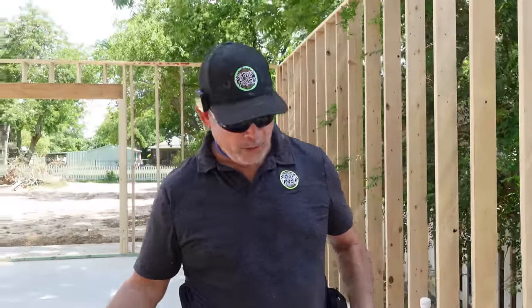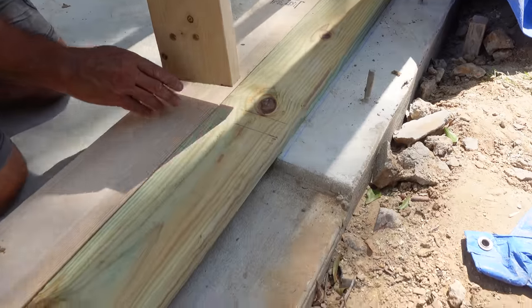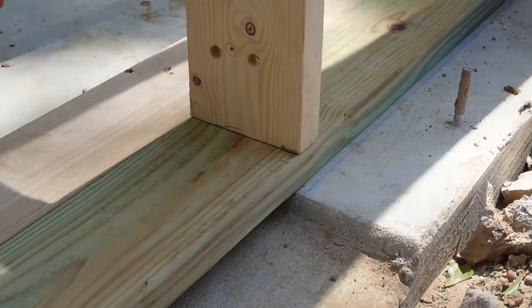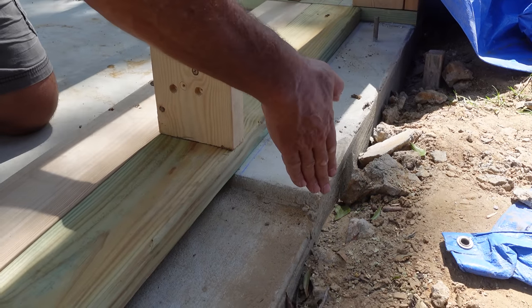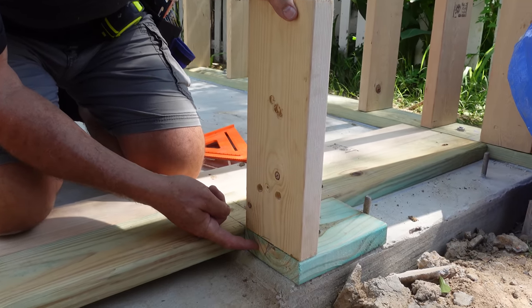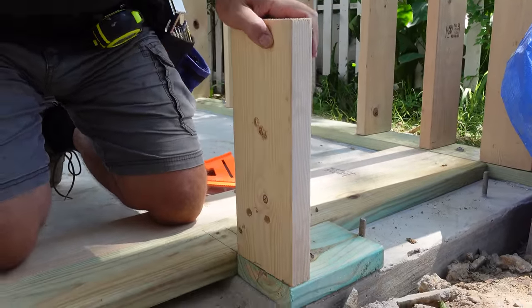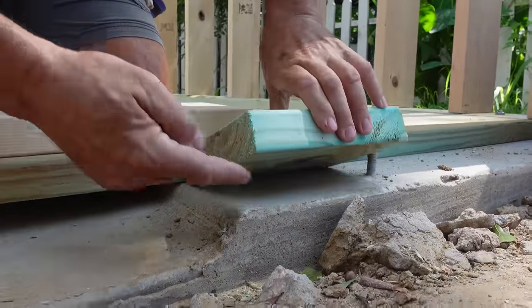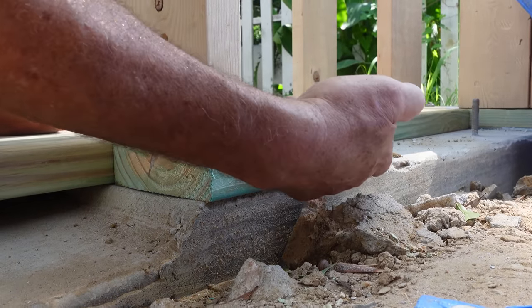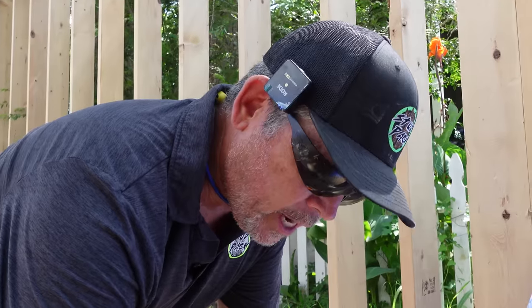What's the rough opening for an 18-foot wide garage door? It's 18 feet — from the jack stud on one side to the jack stud on the other. We're going to set this back another half inch because we're going to wrap our zip sheathing — which has an integrated water-resistant barrier — around this corner. The jack stud has no defenses otherwise; typically they use a piece of 2x with a big bead of caulk that fails, gets wet in driving rain, and rots. Staying on a bulletproofing note, we'll also put Lexel under here so water doesn't get under the end, and possibly Lexel between the framing and the inside of our sheathing to help our blower door test.